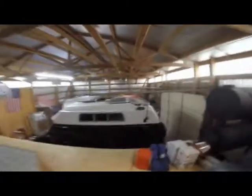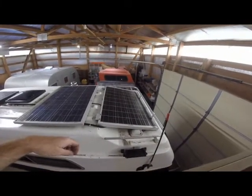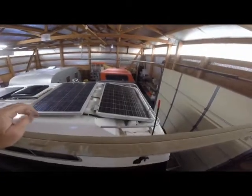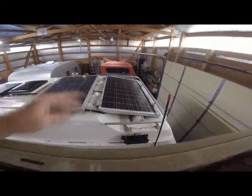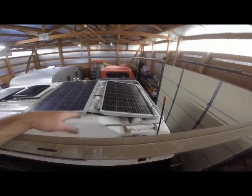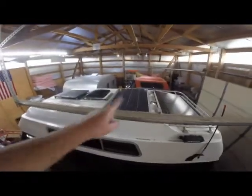I redesigned my system three times because my usage changed, and I'll go through how and why. As far as the panels go, this back panel here is a 100-watt mono-crystalline Renogy panel — I've always had that from the beginning. I added the other two in phases. It's on a tilt in a luggage rack on top of my high top, so as long as I point the back of the van south, it gets very good sunshine. I'm now up to 230 watts — another 100 and a 30.